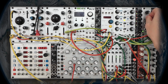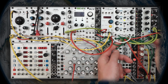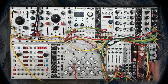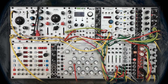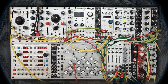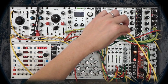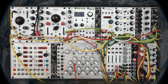Bring in the kick. I'm going to pull the kick from the mix and patch it through another VCA and patch the output of that VCA back into the mixer. Open it up, and we're just as we were, but we have another VCA in the signal path. Now this VCA needs a control voltage to open and close it, and for that I'm going to tap into the gate that's triggering our kick's envelope. Put in a stackable here so I can mult the signal. Take that mult, and that is now our CV for our second VCA.